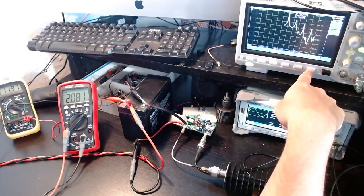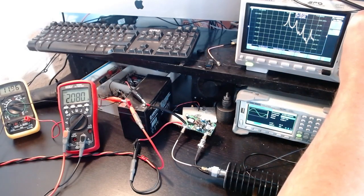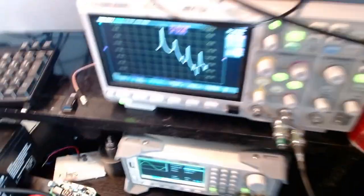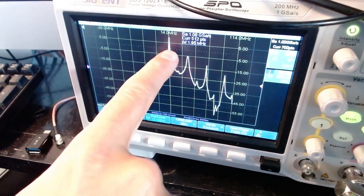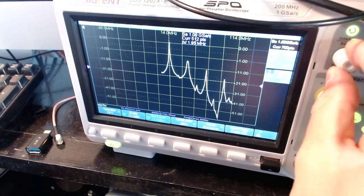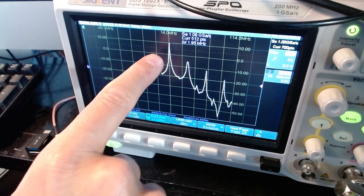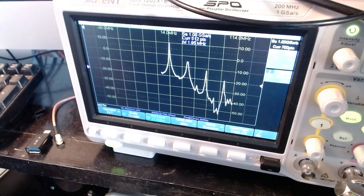Adjusting the reference level to get a clearer view — setting it to 20 dBm — and yes, we are at precisely 10 dBm on the FFT. Fantastic! The amplifier is amplifying exactly 26 dB as specified and is producing the 10 watts of power it's supposed to.